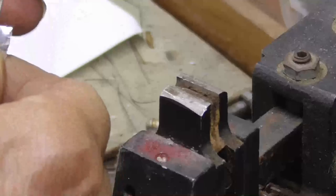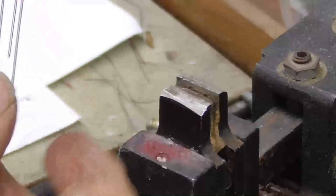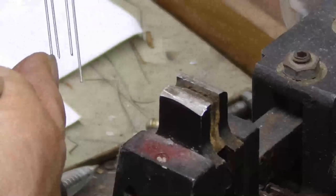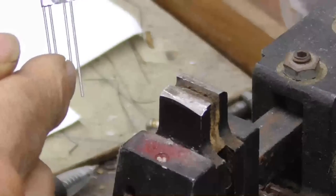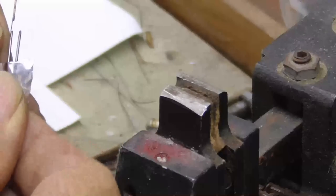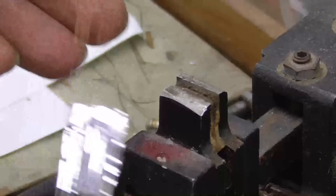Okay. So that gets our feed-throughs, and then we have the support wires. We have one that goes on the outside of the plate, and we have the feed-through to the plate, and then we have one goes to the feed-through for the grid, then we have the other side for the grid, okay? And that's going to be for making the plate and grid seal.